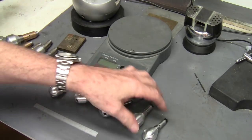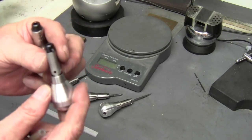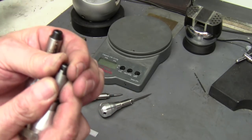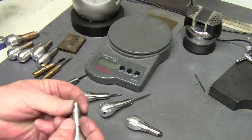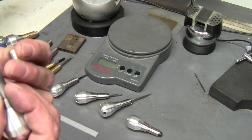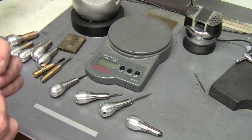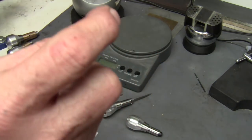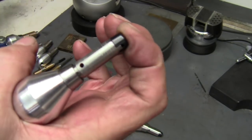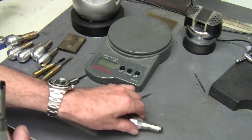I've also tried an even smaller one. This has about a .366 diameter with a quarter-inch hole all the way through, so if your tool holder comes out it's going to spit the piston out. The piston only weighs one gram in this — as you can see it's a pretty small handpiece — and it works, it just doesn't have the power that the ones I'm building now have. It'd probably work fine for very light engraving.